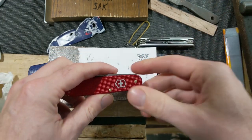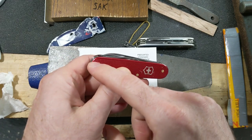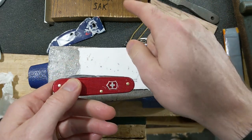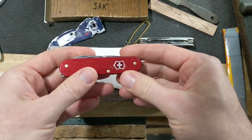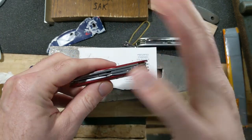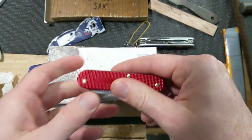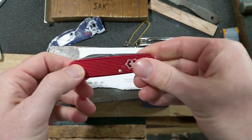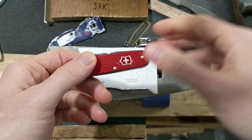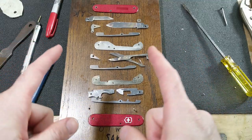And the other thing that's going to allow me to do is to really be careful about the pins. These pins are the ones that I used in the jig that I made, and so maybe they're a little marred up and bent, which may also be contributing to how things are opening and closing. So I'm going to be really precise and careful about the pins and make sure they're good and polished before I put this back together with them. So we'll just disassemble. Now, let's make some new pins.